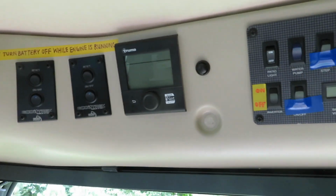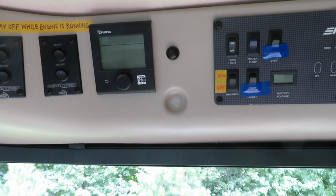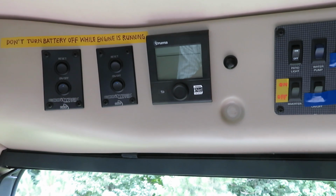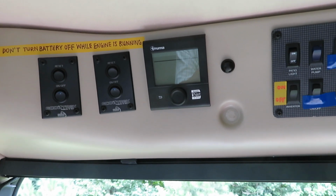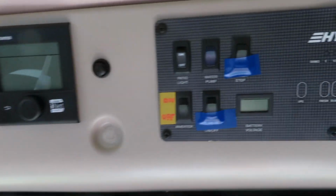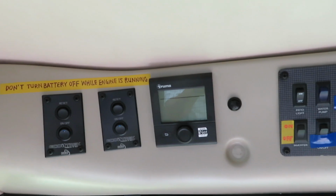Unnecessarily. So in order to charge the battery safely without backdoor overcharging, there are 4 conditions that need to be met. The first is the charger must be on the charge side. So the underhood generator is always on the charge side, and then the load must be on the discharge side. And the factory configuration wires our DC load on the discharge side. So the first 2 conditions have been met by the factory configuration.